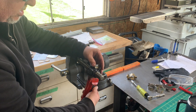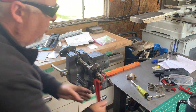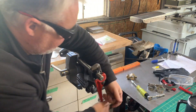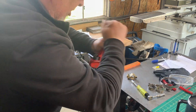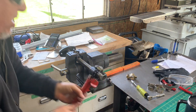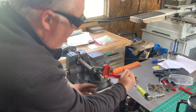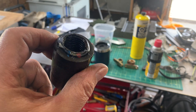This is a left thread, and you can see it's really tight. So clearly I'm going to have to make these threads a lot looser than what they are for the final product. I finally got it off and as you can see it formed beautiful threads. This is a fun way of doing this, but I've got to give this some thought on how I'm going to loosen up those threads — there's no point doing anything else until I can do that.